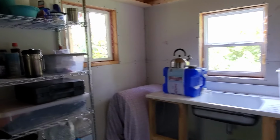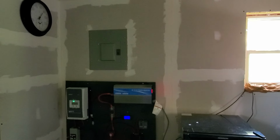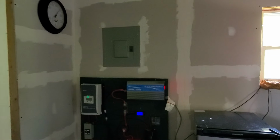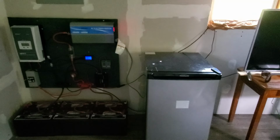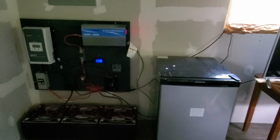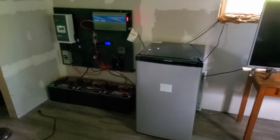All right. So, 28 volts. So, it's basically running off the sun right now. If it's using 100 watts, then the sun is providing all but, what, 17 watts? And as the sun moves over more, and it really starts soaking in that sunshine in the panels, the whole thing will be running strictly off the panels. And about 7 or 8 o'clock tonight, the batteries should be completely full. Then the refrigerator will be running completely off of the batteries.